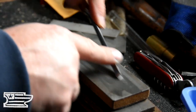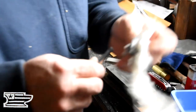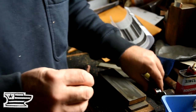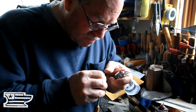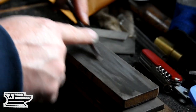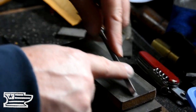I don't know if you could ever film that down there, but you could draw it and explain what you're doing. The whole thing on Vs is just the fact that people don't get the inner and the outer lined up. And when you don't get that, you never have a good V. You just have to go back, square the edge, and start over and fix it — because you can't see how much you're off until you've squared it.